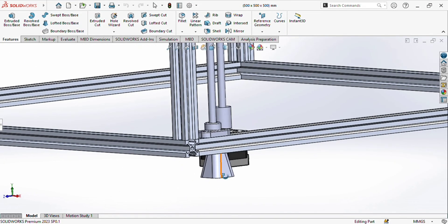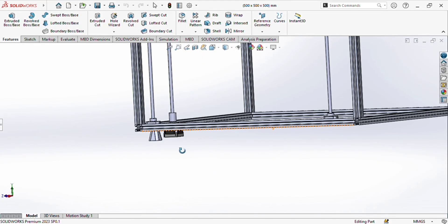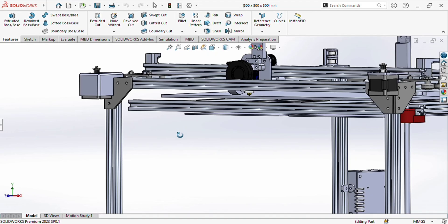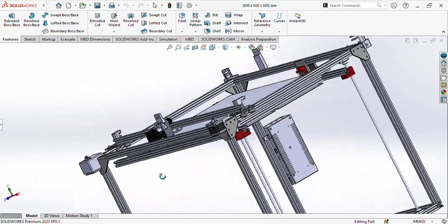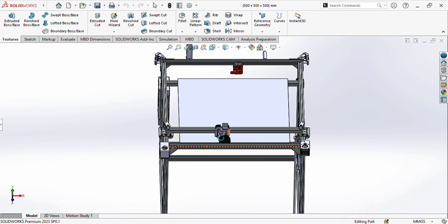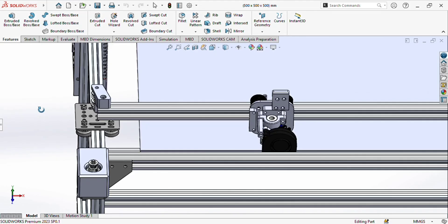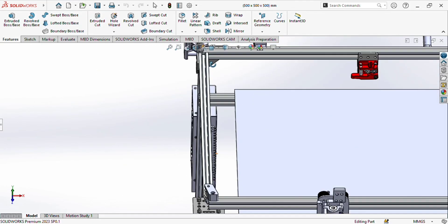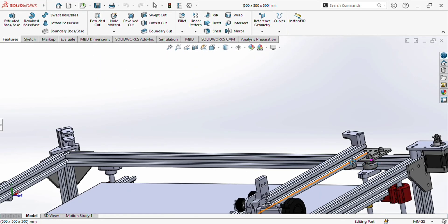This is the base holder — as you can see the NEMA 17 motor is coming down out of the frame, so you will use base holders to keep the frame balanced. This is the CAD model of the 500mm CoreXY 3D printer. The X-axis and Y-axis will move like this. For the X-axis end stop, the end stop will be here and we will add a 3D printed stopper here which will serve as the home position. For the Y-axis end stop, it will be placed here, and the Y-axis will home when the gantry touches the end stop.